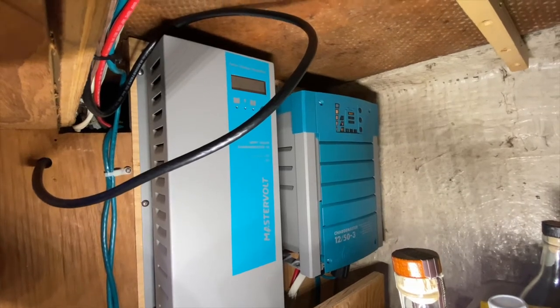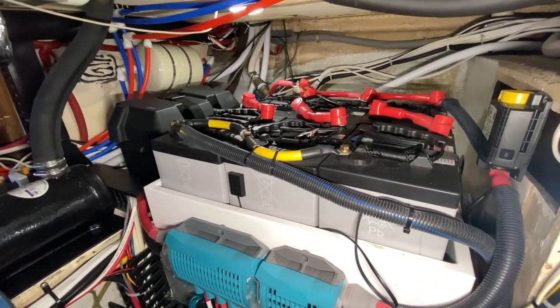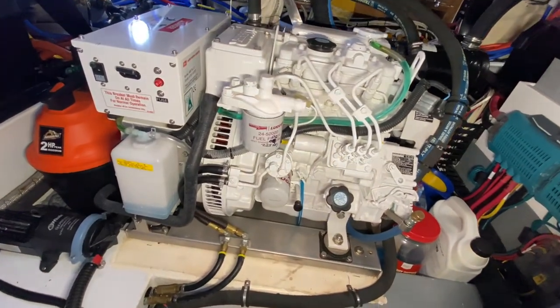When we're at the dock, we have 50-amp service with two 30-amp shore power cords that can be plugged in. You can use either one 30-amp cord for primarily running the boat, or the secondary 30-amp cord which allows you to power the air conditioning and additional systems. The inverter system runs with 1200 amp hours of Lifeline AGM batteries. The system also has a Mastervolt Charge Master 50-amp charger, which works with shore power and also allows you to recharge the house and engine batteries when the generator is running.